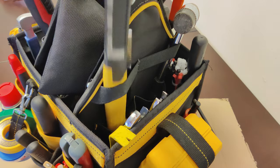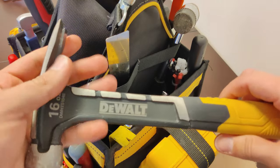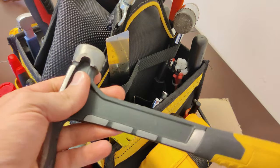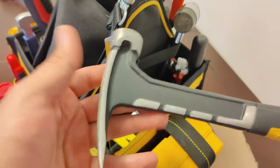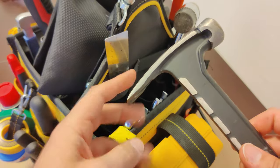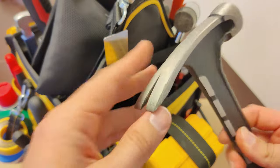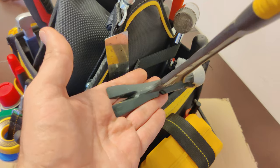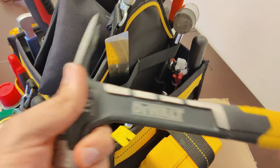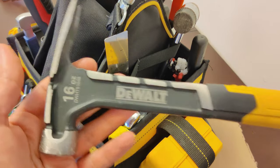Let's start off with the big one — the hammer. This is a 16-ounce rip claw hammer. You use it obviously to drive nails and pull out nails using the claw. The reason why it's called rip claw is because the claw here is not curved — it's a straight claw — which makes it easier to use it as a wedge and to pry things apart. The 16-ounce size is actually the perfect size because it's relatively lightweight and small.